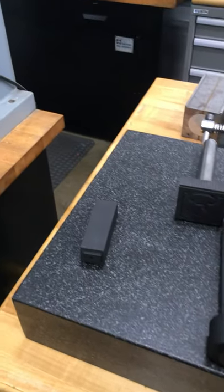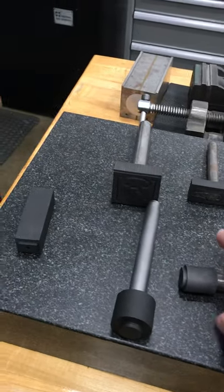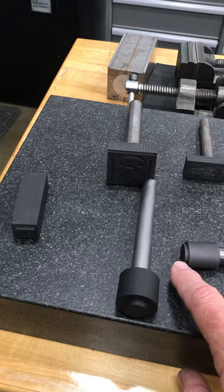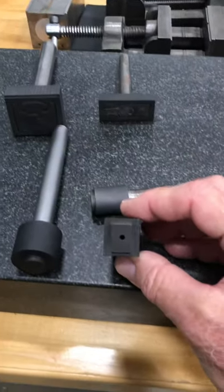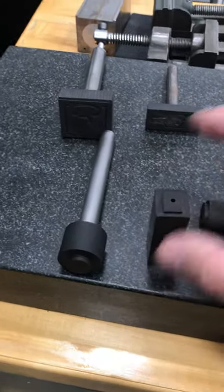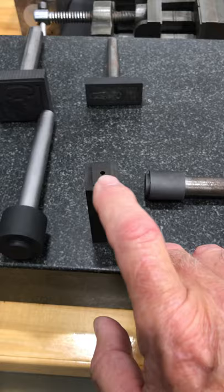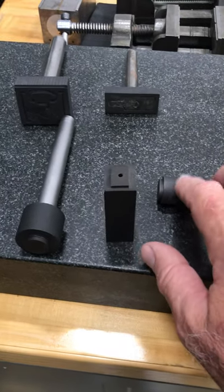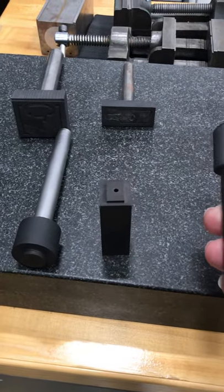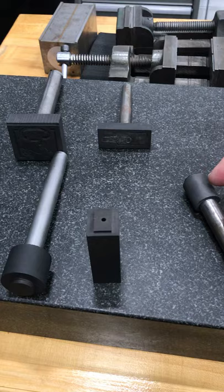Let me show you some examples. First, we'll be gluing an electrode onto a rod — chucking it up in the lathe and turning the diameter down to the dimension specified on the drawing. We're also going to machine this on the Bridgeport in the grinding room to a rectangle to a specific dimension as required on the drawing. This is called the tipping method, where we glue an electrode onto a piece of metal.